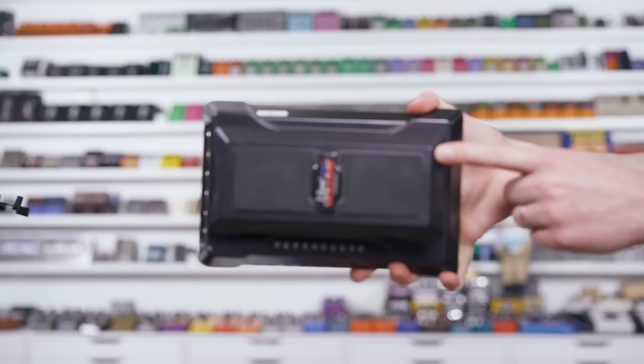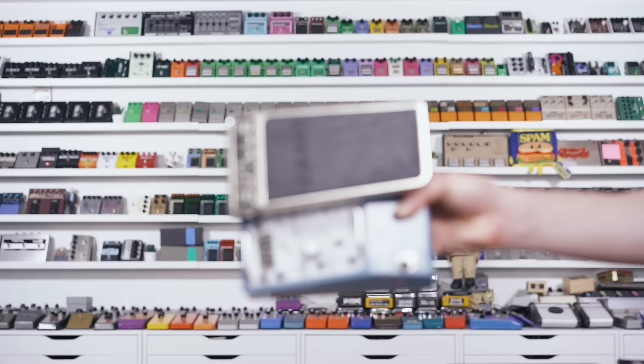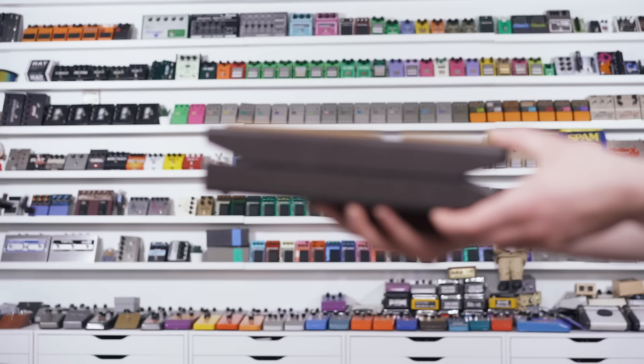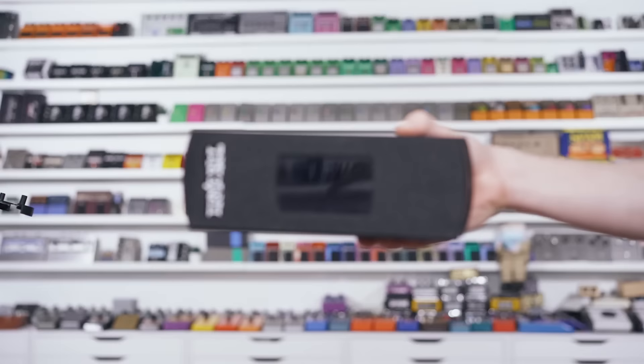There are some other styles. We have things like the Visual Sound Visual Volume, which is a crazy feat of engineering — you'd be amazed how hard it is to show with LED status where you are. You have over-the-top stuff like the Sonus that does volume effects as well as volume. And you don't have to use a string in a pot — you can use optical sensors, or in the case of the Layla, a magnetic sensor: as the toe goes down, it gets closer to a magnet and that affects the circuit. Ernie Ball also has fancier stuff like this one with the tuner.